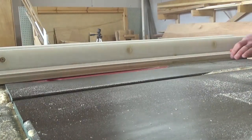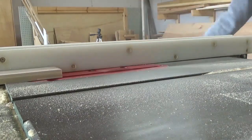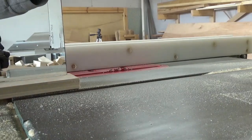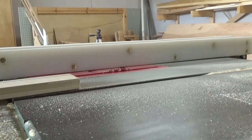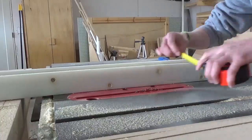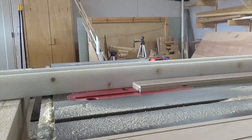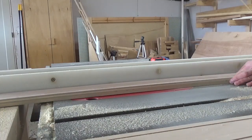I had ordered a 24-inch by 24-inch by an eighth-of-an-inch thick mirror from my local glass shop. I tried to slide one into the dado, and it was a little bit too small. So I adjusted the rip fence again about half a blade width further from the blade and ran it through again. This time the mirror fit, and I was ready to cut these strips down.